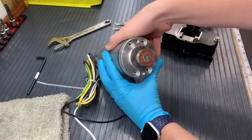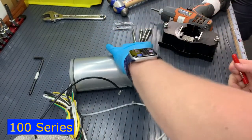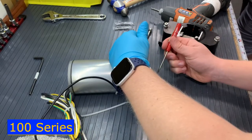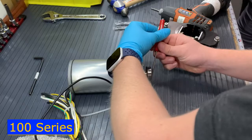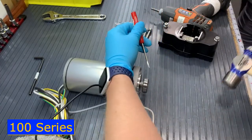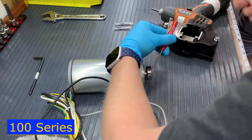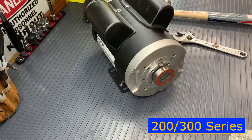Now we will work at getting at the cam. For the 100 series cams, you will need that small screwdriver and the hammer. You will want to set the screwdriver in the hole on the cam as shown here and hold it comfortably, but you want to hit it in a way that it is tangent with the spinning of the cam — also counter-clockwise — so this cam will spin off. It may take a couple of hits, but it should come loose and you should just be able to spin it off with your fingers after that.